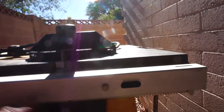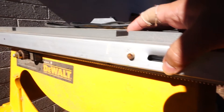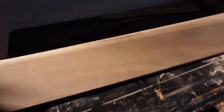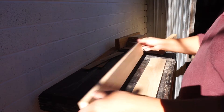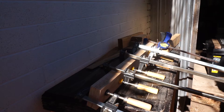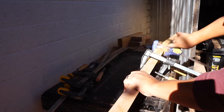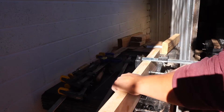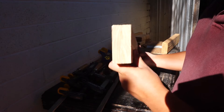Here are the metal pins that the old fence used to register to. We're going to try to find a solution that will use these pins so that we can have a functional fence. This is some red oak that I got from Home Depot for fairly cheap — it looks like a fence so we're gonna give it a go. One piece was a little thin so two pieces together will give it more mass to screw on to from the outside and hopefully straighten it up a bit. I let the glue sit overnight — just simple wood glue — and it looks pretty good. It's definitely straighter than it was straight from Home Depot.